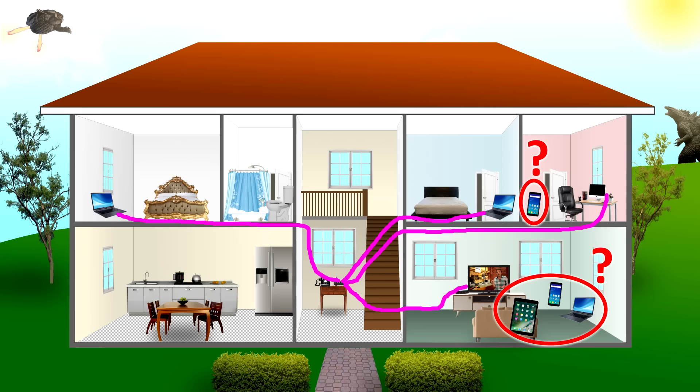Now that we understand how to route cables, you're also most likely going to have to drill a hole through the ceiling at some point. Figure out where the optimal route is — don't drill into any electrical conduits. Another fun trick: if you have forced air heat and cooling in your house, you may be able to route Ethernet cables through the ductwork. Using cable tacks or hot glue, remembering not to crimp the cable, don't crush it — route it around the perimeter of the room.